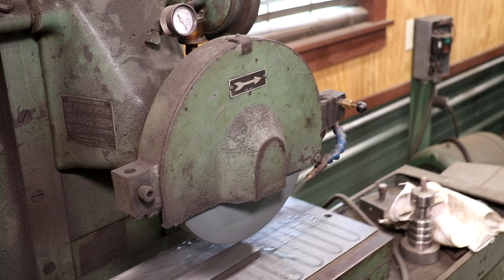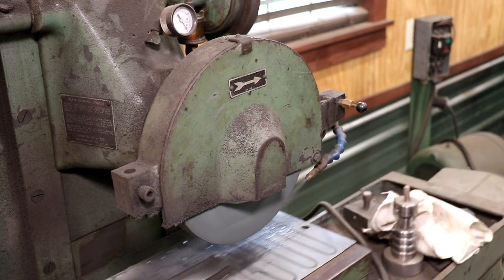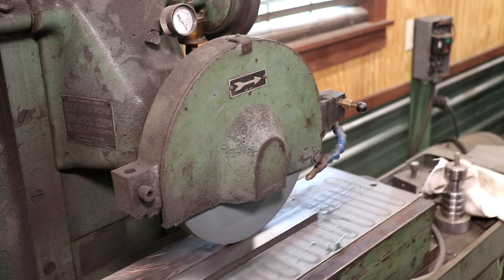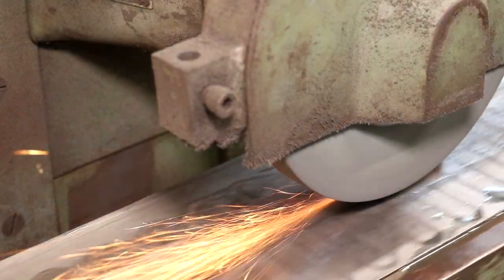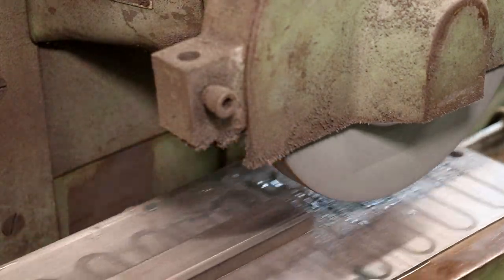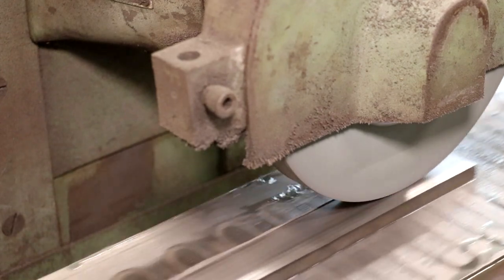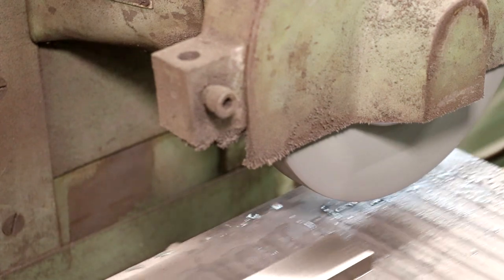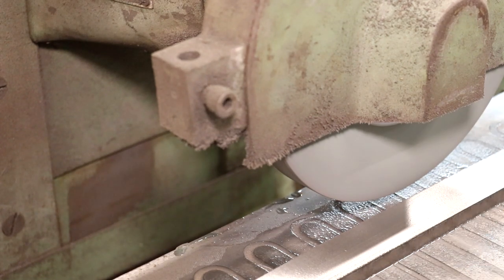Going another 2 thousandths. We're slowly working it out. So far I've cut probably 5 or 6 thousandths off — it's coming out pretty quick. Let's take another 2 thousandths; that'll make about 8 thousandths total. That is going to pretty well clean it up. I see just a couple of lines down here on the backside, but I'm going to leave it like it is for now. I'll flip it over, and if I have extra material at the end I can always come back. Another thou would easily get that, but we'll just leave it for now.